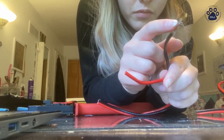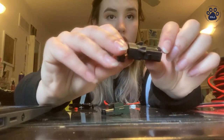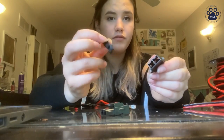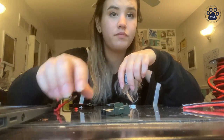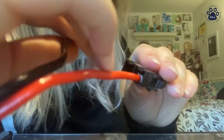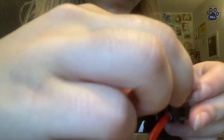Same kind of terminal on both crimps. You're going to put it in the correct housing: male has a mohawk and female does not have a mohawk. So we've got male terminals going into female housing. Take the safety off and put it in the correct position — positions are outlined in the standardization doc. Red goes in this position, put it in upright — you'll hear a click — give a little tug. Black goes in the same position, upright like that.